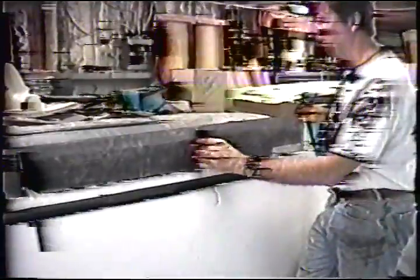But you can either micro them in or T-tape them. You can see that this has also been filled with micro, and then it was closed as though it were a T-tape operation but without the glass, giving you a nice surface to bond to. Now from there, we're going to go into bonding. And the last step is just bonding this skin to this surface.